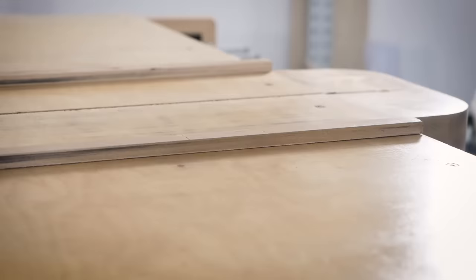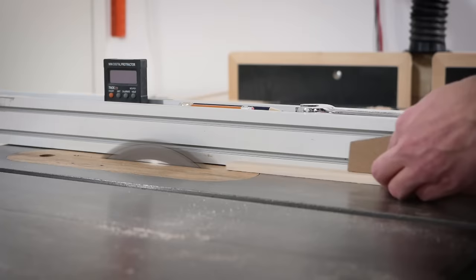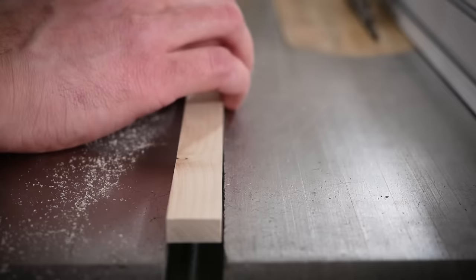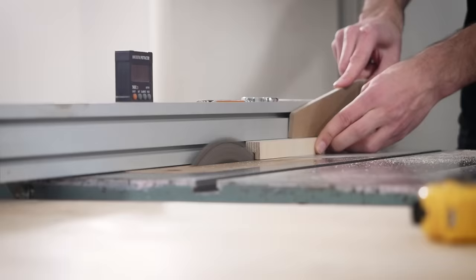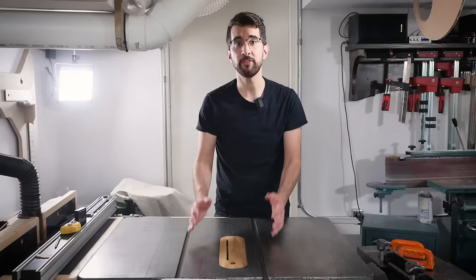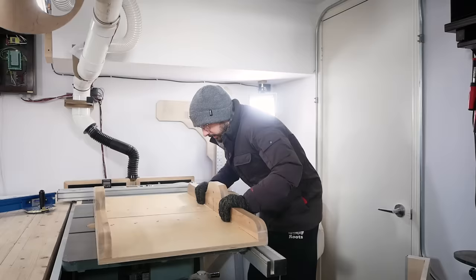The miter rails or miter bars guide the sled through the miter slots on your table saw top. These can be made from wood or purchased from a manufacturer. If making them from wood, sneak up on the perfect fit by taking the smallest amount possible off and checking each time — you want the fit snug so you can adjust with sandpaper later. Use hardwood plywood like Baltic birch, which is both stable and dense enough for long-term use. Solid hardwood like maple can cause seasonal fit issues as it expands and contracts with humidity. Don't make them out of softwood — they'll be unstable and not durable at all.